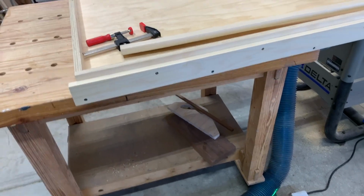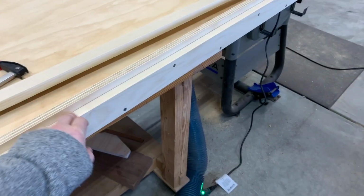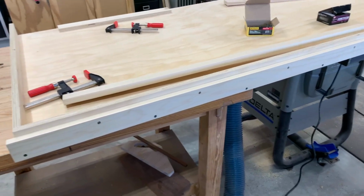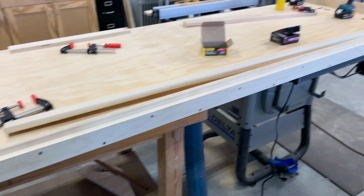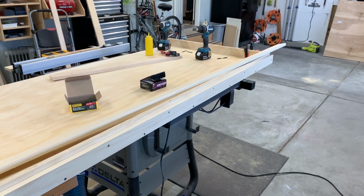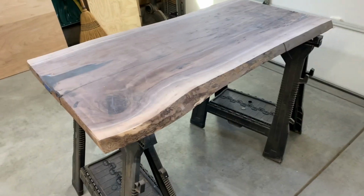But yeah, overall, it's a pretty simple process. So we're obviously wood gluing all this stuff. I am gonna caulk it just to fill any of the seams to try and prevent any water from getting down in it. And then once that's done, like I said, I'm just gonna Herculiner the whole outside of the box to waterproof it and UV protect it. So yeah, more updates to come.